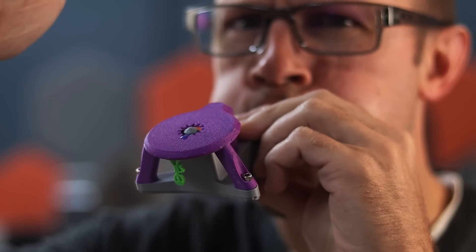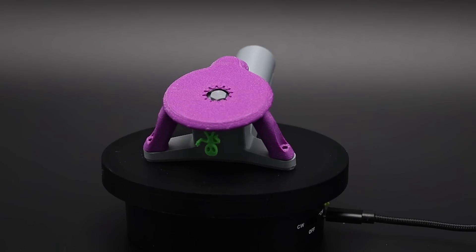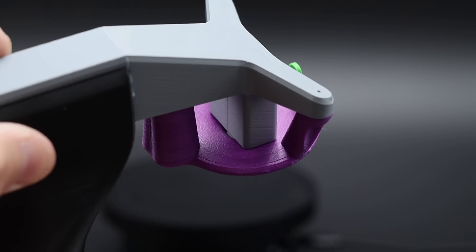This duct is quite restrictive when blowing into it and wraps around the nozzle very close. I was concerned there would be no place for the air to go, especially on the first few layers tight to the build plate. Luckily the duct has several millimeters of clearance to the tip of the nozzle. However there is no clearance to the silicone sock, partly because the heater is slightly offset to one side, so we'll see if it melts.